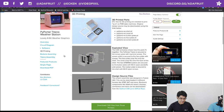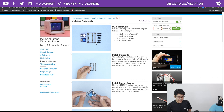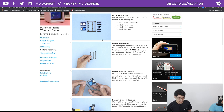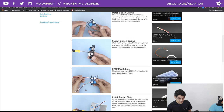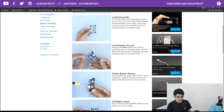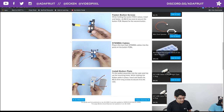The rest of the pages cover hardware assembly — how to set up the buttons and walk through the hardware screws. That's why I suggest the M2.5 nylon standoff kit — it has everything you need. I think it's really nice to have hardware standoffs: instead of building them into the 3D print, you can always swap them out for different depths. I like doing separate pieces because if tolerances are off, you just reprint that one module rather than the whole case that takes five or six hours.